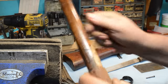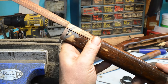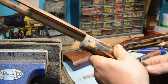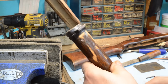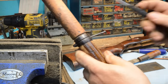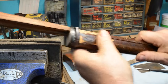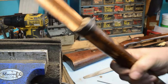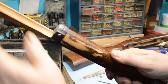That sticks out. The reason why we open this up — taking off that wood — is because now we can take this nut and slide it up on there. You can see it's flush and we can get the screw in it. So we're doing all this up in the air — we're not doing this after we glue it all together. We're square here in the front, square here in the back, and we have this leveled off. So now we know we've taken care of all of the missing wood. By the time we oil this all down, this will disappear — you won't even know we did it.